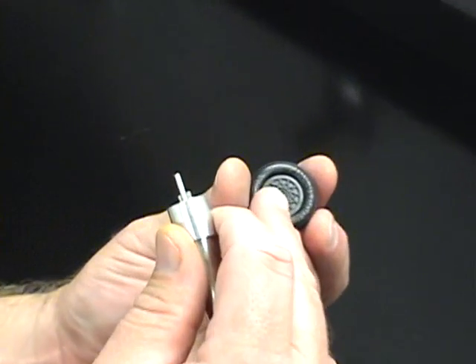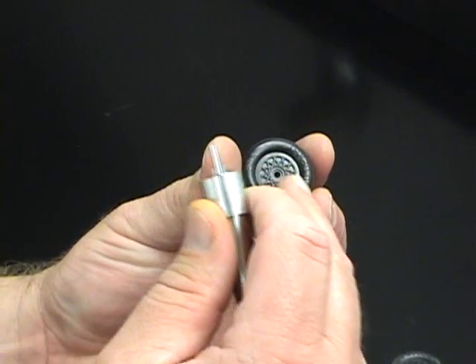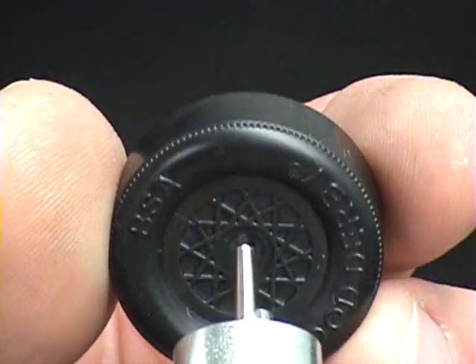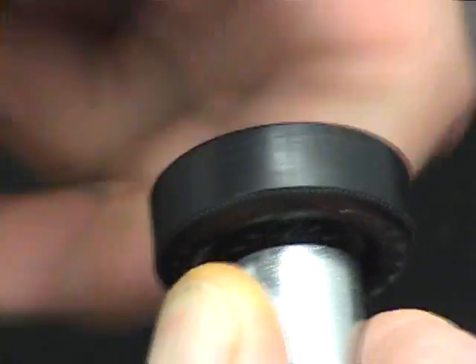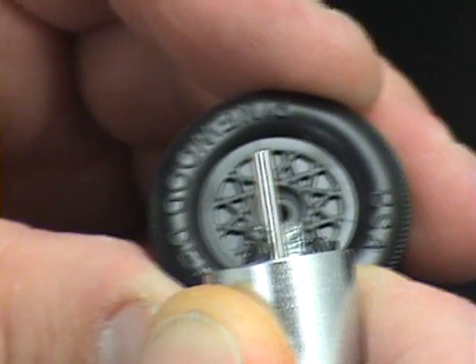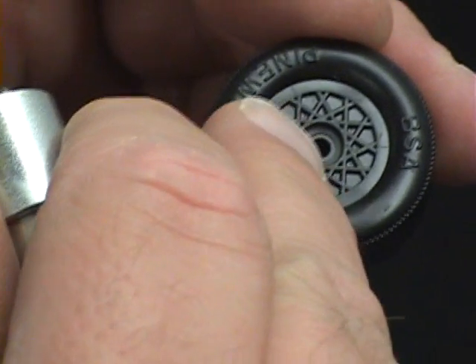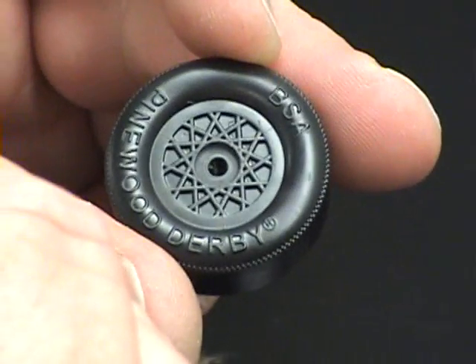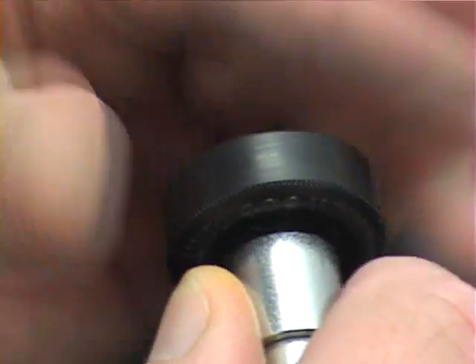On the new wheel, we're going to make this cut slightly deeper and remove the secondary step, again bringing the point of contact of the axle head back to the inner hub. Install the wheel, apply a slight amount of pressure, take it off and inspect. We want to cut until the upper level meets the lower level. A couple of checks may be necessary to keep from over-cutting.